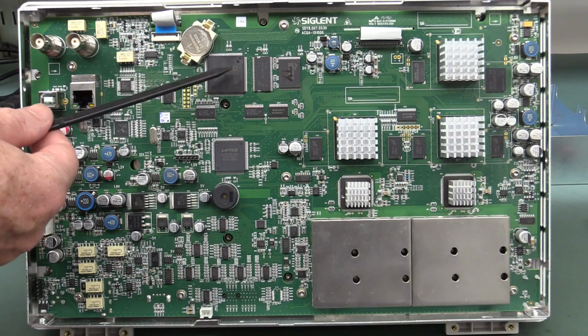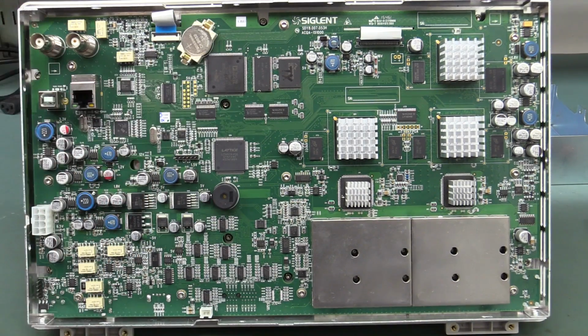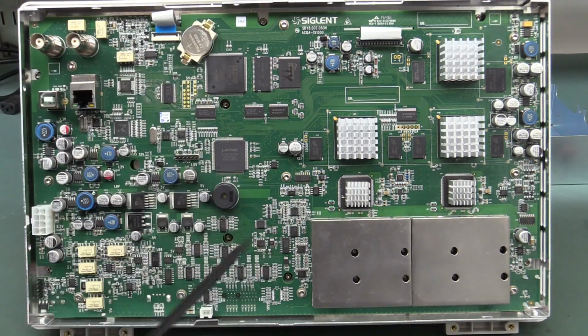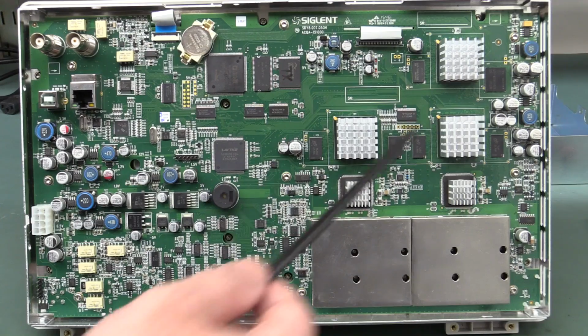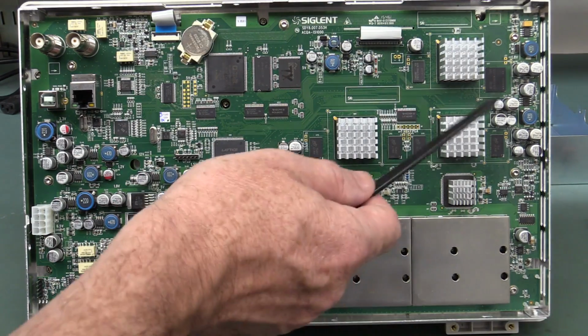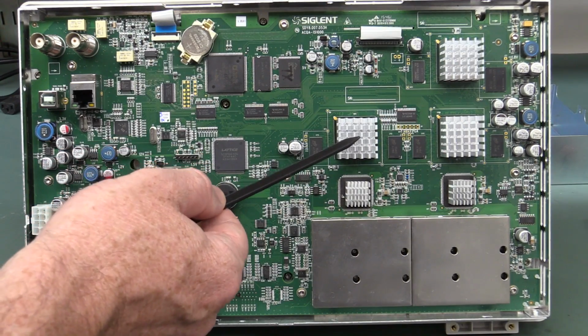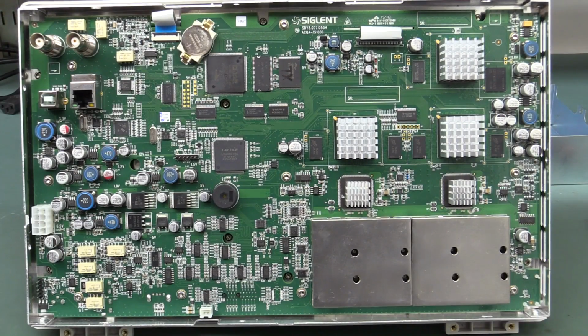And of course, that's a Blackfin DSP. It will be running the OS for this thing, which could be some embedded Linux or whatever flavor of OS that's actually running, and it's handling all the user interface and the Ethernet and everything else, and the cursors and the front panel and all that sort of jazz, and the USBs and things like that. But all the acquisition, dumping the data, is done: it goes from ADC to acquisition FPGA straight onto your display processor, and then bam, straight out to your display.